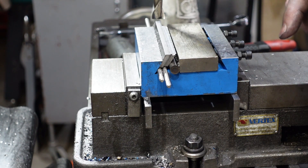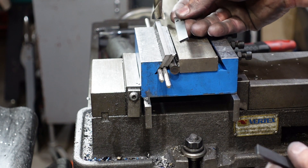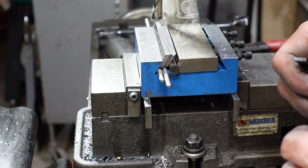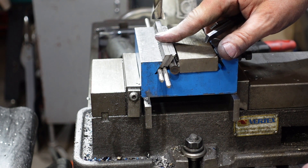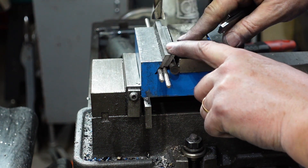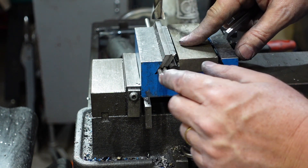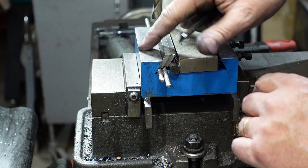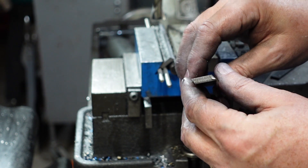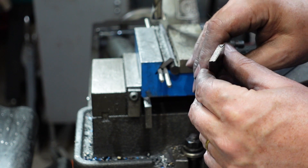These are the replacement dovetails for the XY table. They're made out of five millimeter thick steel instead of three, and they're also the full length of the dovetail rather than just a little bit shorter. I've put a 60-degree angle on there — that's pure experimentalism. I've been wanting to try this method out for years. Basically you're using the dovetail of the thing it's going into to set your angle, then you push on it with a rod to get the clearance over the surface, with a block to push it all in.